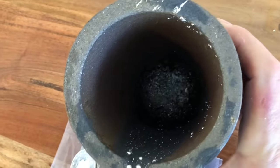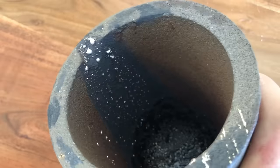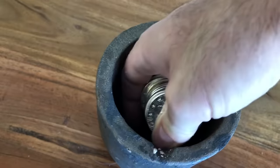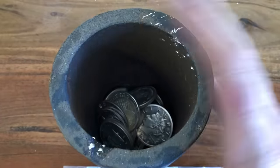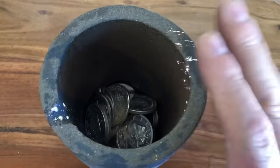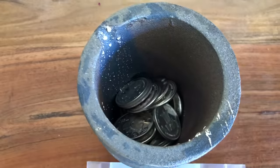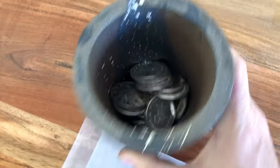I'll be using my crucible that I have reserved only for silver. There's actually a little bit of silver still stuck on there, but nothing significant. I've got 23 1 ounce rounds. And the goal today is to pour at least 10 to maybe 11 bars, right around 2, 2.1, 1.9 if we're light, but somewhere between 1.9 and 2.1 troy ounces a piece. So let me go ahead and get this fired up in the Devil Forge and we'll get to pouring.